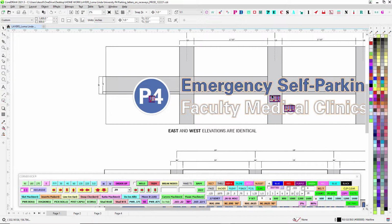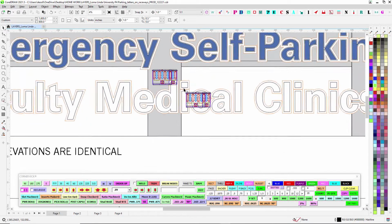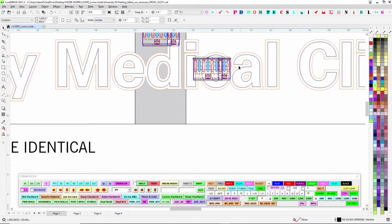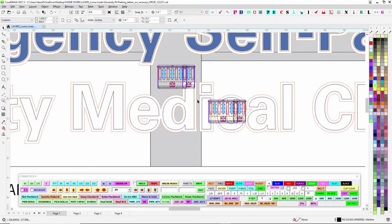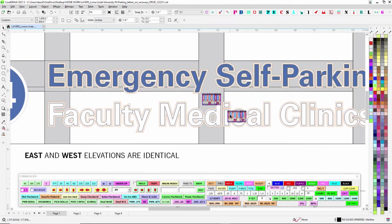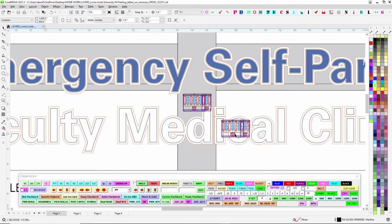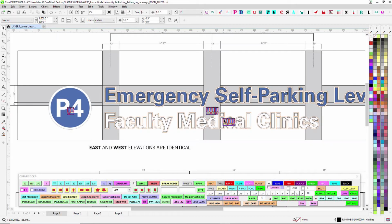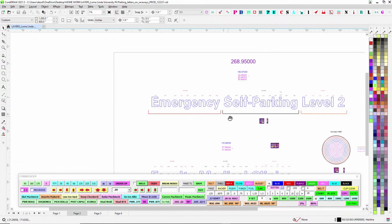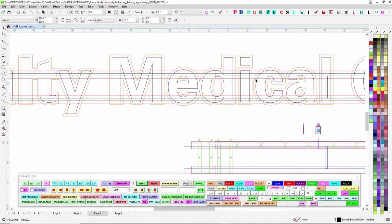And then from there, even if they don't do it for us, we could run an EMT across and then power this guy. Or, as I was laying out the raceways, we could transfer it to the backside of the 2 raceways and paint it and stuff. It is what it is. Then they can run the power to it here, and it could still be centrally located but self-contained, if you will. So it could sit right here in between.